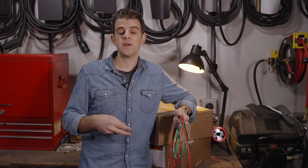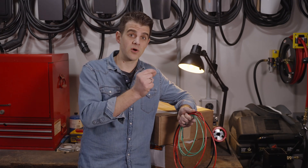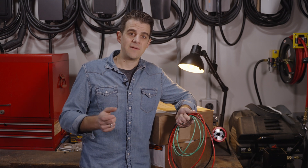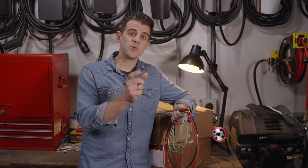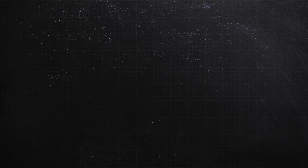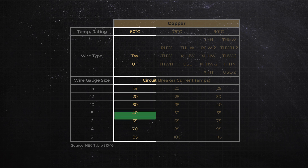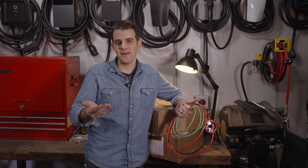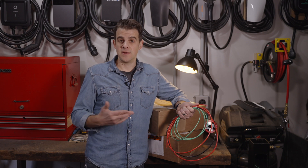There are two ways to think about this overreach. One is 125% of your current draw — take 40 amps, multiply by 1.25, and you get 50 amps. The other way: if you have a 50 amp circuit, 80% of that is available for continuous load, which is 40 amps. So we need a 50 amp circuit. Scrolling down the 60-degree column, you'll see that a six gauge wire is acceptable on a 50 amp circuit. If your wire is oversized, that's always good, but it will cost more.